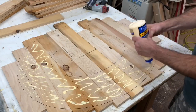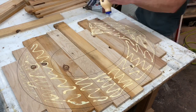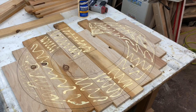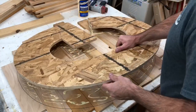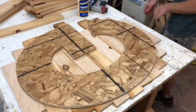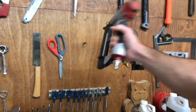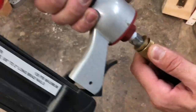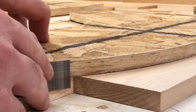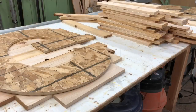Try not to get outside any trace lines, that way you don't get glue on your router bit when you go to trim it out. I like to use Titebond 2 or 3 for this — it doesn't really matter — or any good wood glue; I just prefer Titebond. Now you can grab your backer board and place it inside the trace lines. Try not to move the boards around — you want them to stay where they were — then just press it down to start the adhesion. I use a brad nailer with brad nails. Make sure your brad nails aren't too long and go through the front face; I use one-inch on this particular one.